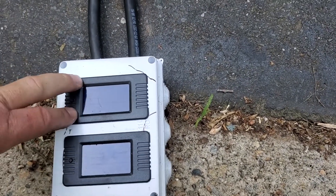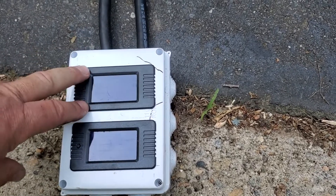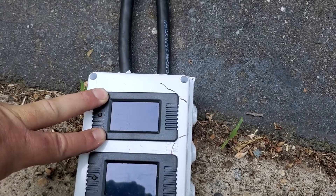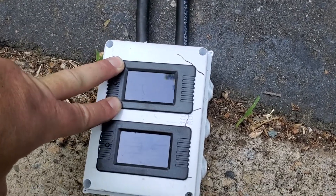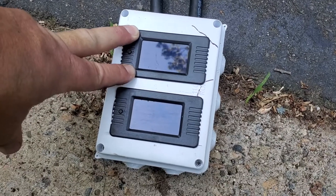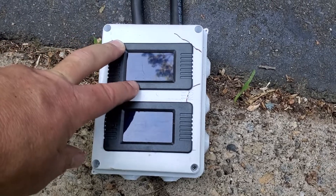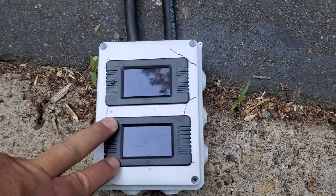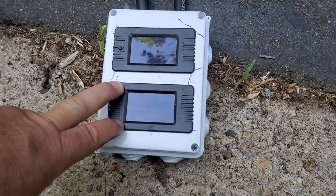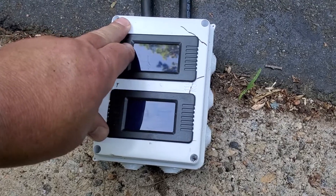As you start seeing 3,200 to 3,500 watts, I wouldn't be surprised if it cuts out. I did a test the other day — a couple of air conditioners upstairs, I don't know if all four were running at the same time, and I had a 12,000 BTU unit downstairs running in the window. One leg was up to 3,200 watts and the other leg was around 1,000 watts.